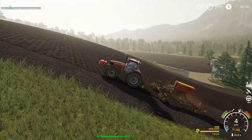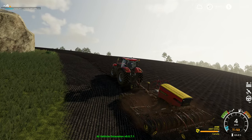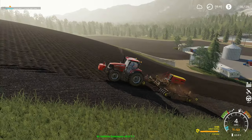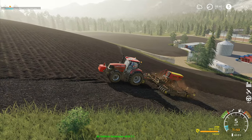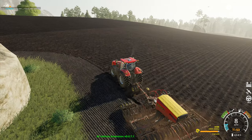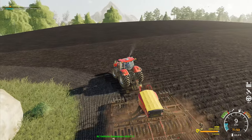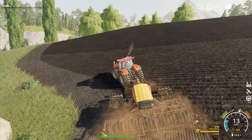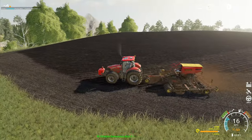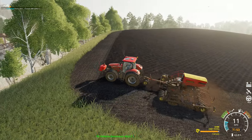It was suggested that perhaps we didn't need the front weight on this one because the weight is behind the tractor and we could just be compressing it down. I'm going to disagree with that because with four-wheel drive fully engaged and pulling up the hill, it's going to be putting less pressure on the front wheels. Having that weight pulling it down is going to help the four-wheel drive to properly engage. The biggest problem is the lack of weight on the back wheels, which is why we'd want to seriously consider having the wheel weights back on.